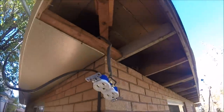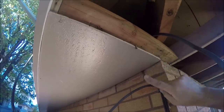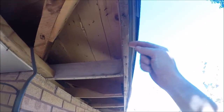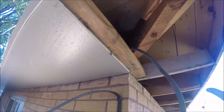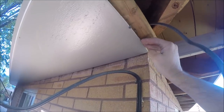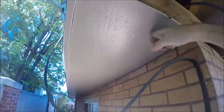All right, there's my power. This here just shows an example of how I work by myself. And there's nobody on this end lining it up with 16 inches from this fascia to here. So when I put this piece of fascia up, the last piece, it'll butt right up tight to this one. And this was my stopper when I put this first piece in.